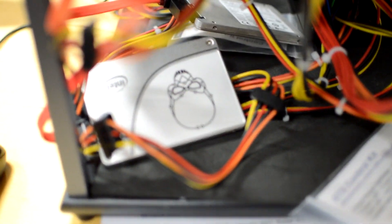The last main feature of these Z97 motherboards is Serial ATA Express. This board comes with standard Serial ATA 3 ports and Serial ATA Express. The way Serial ATA Express works is it's basically plumbed directly into the PCI Express lanes. With standard Serial ATA 3 connections, like all previous generation motherboards, you get a data transfer rate of 6 gigabits per second. With the new Serial ATA Express, because it's plugged directly into the PCI Express bandwidth, you're getting 10 gigabits per second.